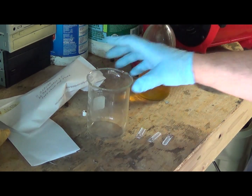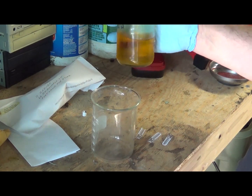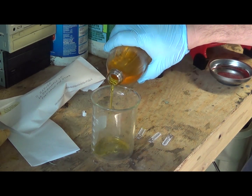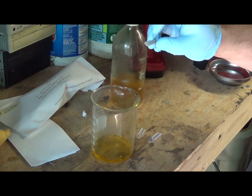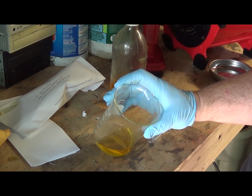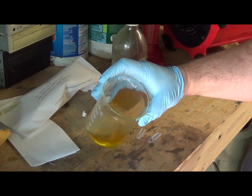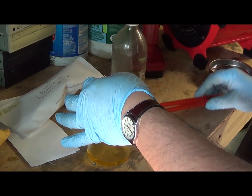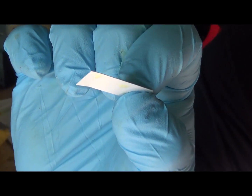What I'm going to do here is take my glass beaker and put a little bit of my auric chloride in there — which is the HCL and bleach formula. This is yellow right now because I've already dissolved some gold in it. I'm just going to put a little bit in. I'm going to be very careful; the fumes from this are very dangerous. Now I'm going to take this strip and just drop it in and swirl it around. You can see the gold is just flying right off there, which tells me the gold is really, really super thin. And there you have it — the gold has been completely removed from it in just a couple of seconds.